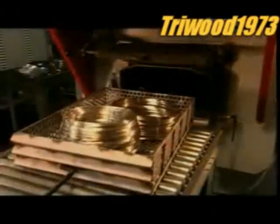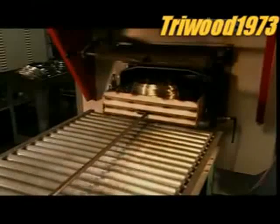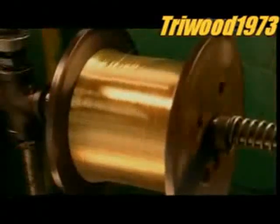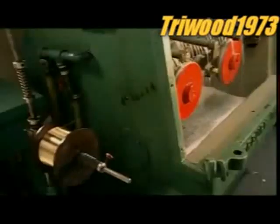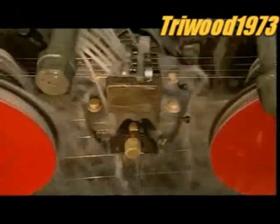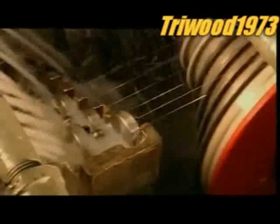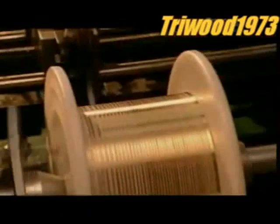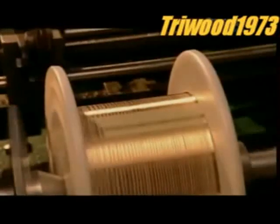The coiled metal is softened in an oven. Then what's now a wire is uncoiled and continues to stretch as it's passed through a die lined with industrial diamonds. To prevent overheating, the machine sprays lubricant to cool the wire while reducing it to the width of a human hair, its final size. The wire then winds into a spool, almost 3 kilometers long.